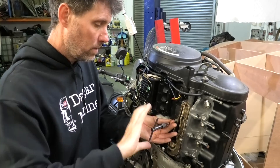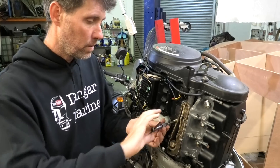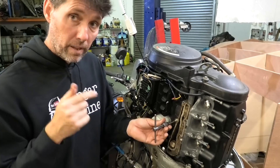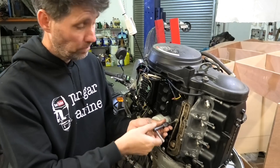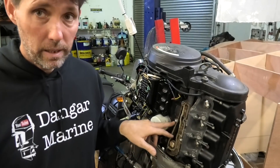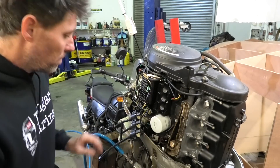I'm going to start tapping a few turns, and then do a little bit of a backward turn just to scoop the chips that I've cut out of the metal into the channel inside the tap, then keep going forward. There's no great difficulty to tapping threads like this — the tool does all the work. I can feel it getting hard to turn now because the tap has hit the bottom of the hole, so all I need to do is wind it back out. I'll clean the hole out very thoroughly using a little bit of brake cleaner because of the grease, and then some compressed air.